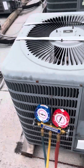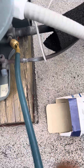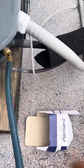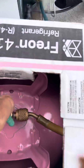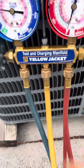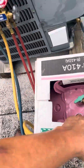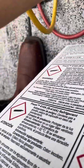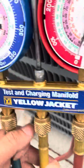We're going to charge a little bit of freon. You always want to charge on the low side, which is the blue — that's the big line, that's how I remember it. You open it a little bit, then come back and purge it so all the air comes out with the freon, and then you flip the can upside down. You always want to charge with the can upside down, and add a little at a time.